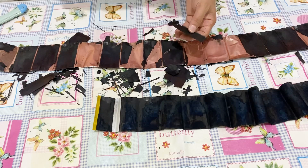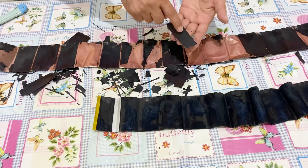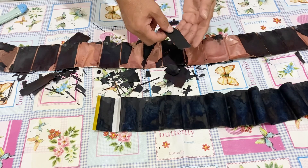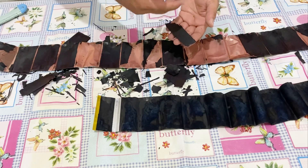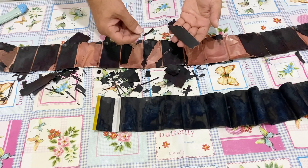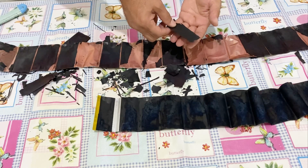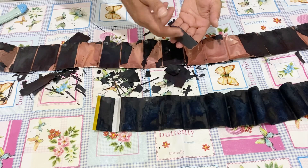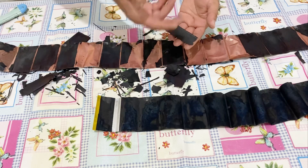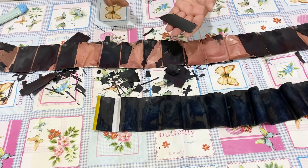The second reason is that inside this active material, a binder called polyvinylidene fluoride (PVDF) is used. Polyvinylidene fluoride is very, very resistant to aqueous-based electrolytes. So if you put your electrolyte into your supercapacitor, it is not going to be absorbed — it will not penetrate into the active material. So the conductivity will be very low and the capacitance will be very low.